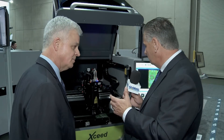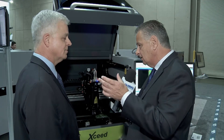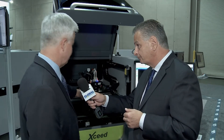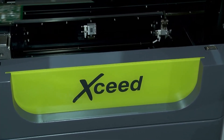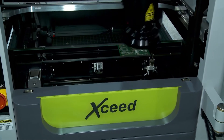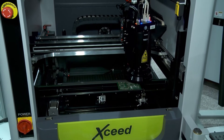The system uses a fairly unique laser triangulation system which acts as a line scanner. On the head assembly, there are two opposing lasers mounted at an angle to a vertical downward viewing camera. The camera views the variation in the scan lines based on geometry and trigonometry, allowing calculation of the heights and shapes of the features being inspected.